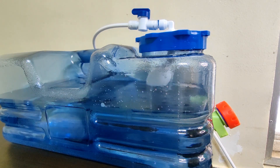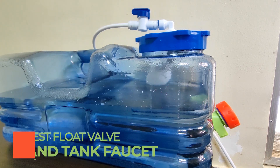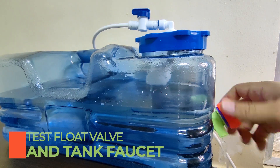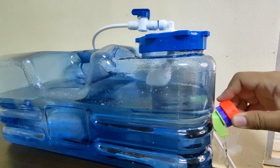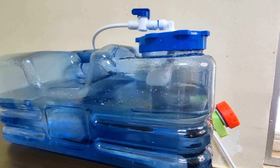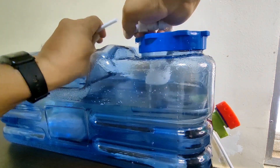Let's wait until the tank is full and test if the float valve will close. It closes. Now test the tank faucet and check if the float valve will open again — and yes, it's working. As you can see, the tank is not yet full, which means the float needs to be adjusted to maximize the storage capacity of the tank.